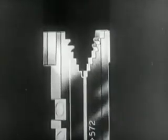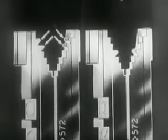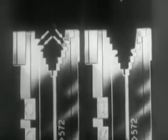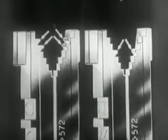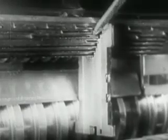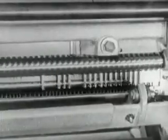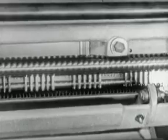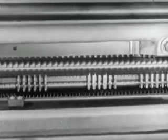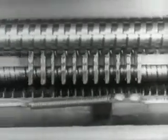For example, the mat of the letter O will remain suspended on the bar with the second and third tooth combination. This other one, corresponding to the letter N, will remain suspended with the fourth tooth combination. When the distributor bar fails to supply the required combination, the mat, no longer having support, drops into the magazine. Therefore, for the ninety magazine channels, there are ninety different tooth combinations, and consequently an equal number of combinations along the length of the distributor bar.